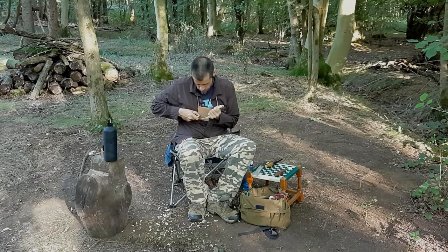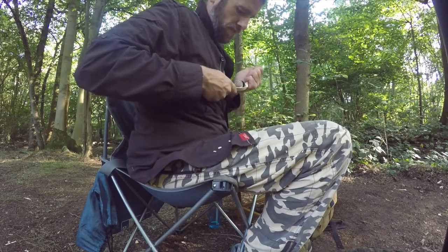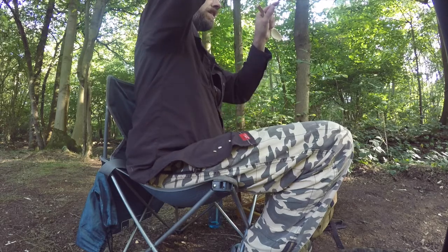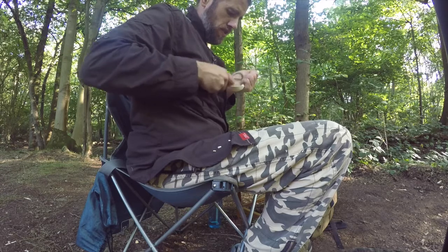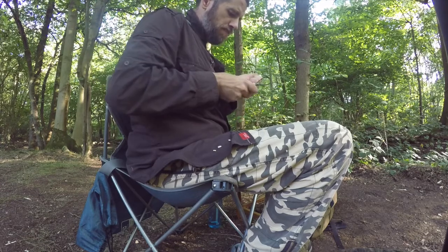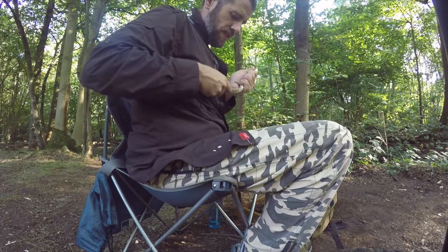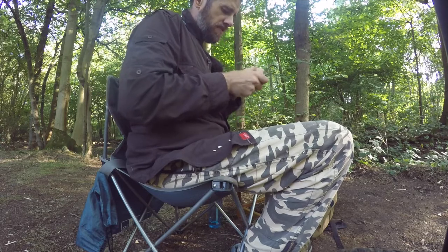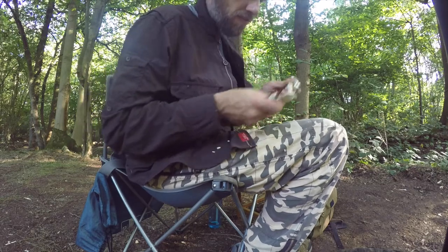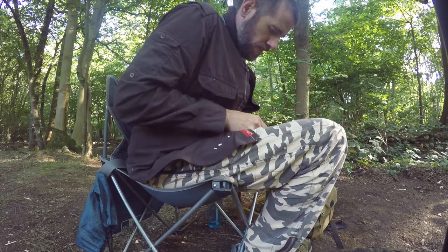Then I'm going to work this one in a chest lever — a modified chest lever. This bib gets in the way a little bit, so I'm just going to sling that round the side for a second. I'm trying to use as flat a part of the curve of this blade as I possibly can, so I leave fewer furrows. I'm just taking off the high spot with each progressive cut and trying to leave as smooth a finish as possible. As I'm approaching that finish, I can take less and less timber with each cut — getting some really nice, paper-thin shavings.